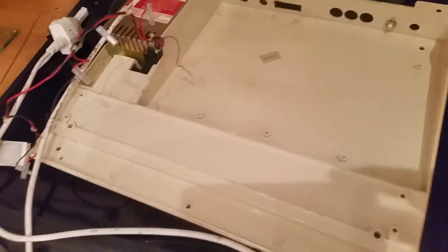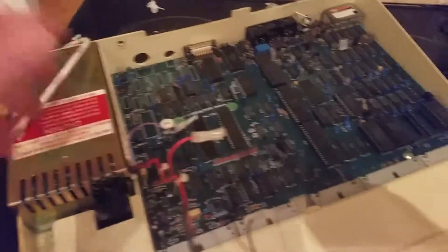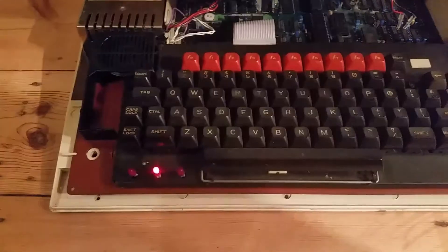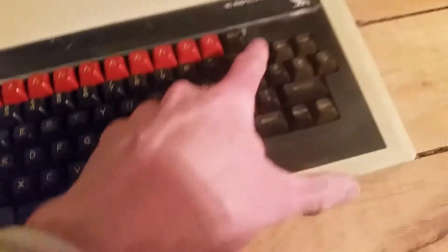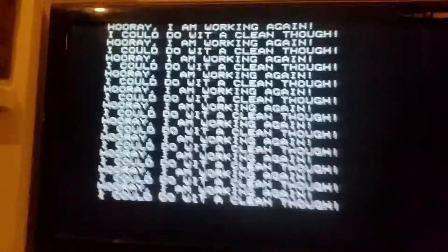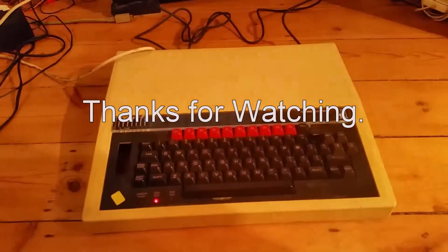Let's see if it works first. To be safe I've got it out in the garden, plugged it in, make sure it can go bang outside. It didn't. I've just checked here on the 5 volts - we've got positive 5V from ground, and we've got minus 5 volts on there. So let's plug it in and see what happens. The modulator might not work because it's so rusty, but the machine is pretty sorry for itself. I've put it back together - as you can see the light's working, a bit of a giveaway really that it's going to work. The case needs some screws, I'm missing a button, it needs a good old clean up. But tada! And that is with the rubbish rusty old RF output - so if I get the composite working it should be even better. It looks like the logic's working - I did a little program. I actually learned to program these when I was a kid. Everything's working. It needs another key and a bit of a clean, but worth doing. See you later, cheers.